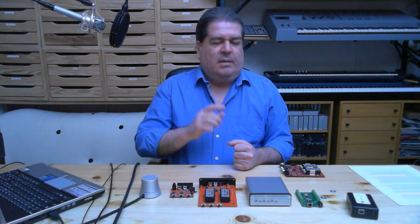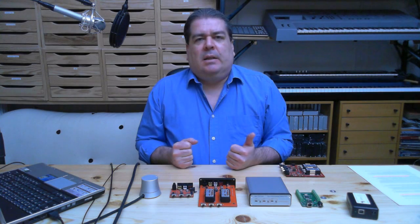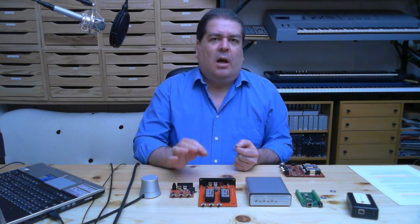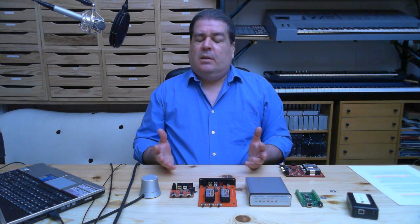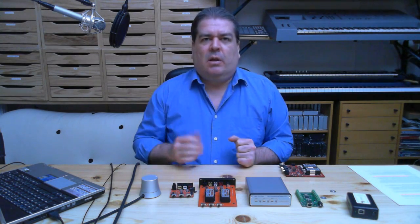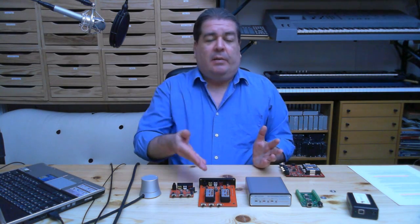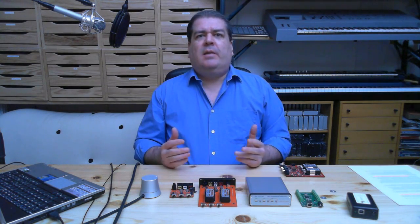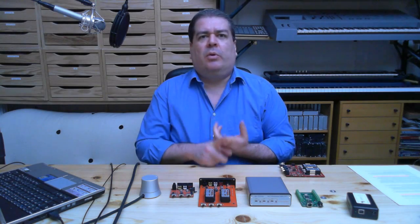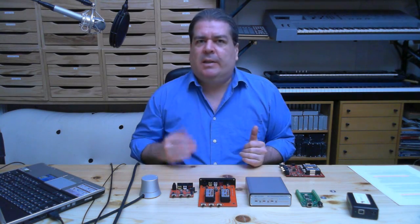What's wrong with asynchronous USB? The people trying to sell you a DAC — who are supposed to have high expertise in designing analog stuff — are telling you they can't design a clean clock that syncs from an external source. What about S/PDIF? With async DACs, they just use a good-quality crystal clock, and when you go to S/PDIF it's business as usual — it can be decent. That means when you have files stored on your computer you get great audio quality, but audio from another source like a CD, DVD, or set-top box transport is just average. You end up with two different sound qualities, and I don't think that's acceptable.